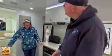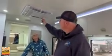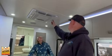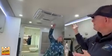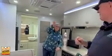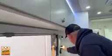Now, your heater air conditioner, you can run it by remote control, or you can do it by touch. That's on and off, and you can touch the controls there too. Now, if you need to clean the air filters, you'll see there's two grills underneath here. There's a rectangle lug on each side of the unit, just up here. Pull those out sideways, that'll pull the filter out with it, and then you can vacuum them and slot them back in. You might need a little bread and butter knife or a screwdriver or something to lever it out. Pull it out that way. So that's how you turn your heater air conditioner on and off.